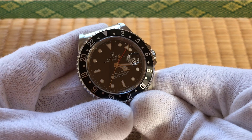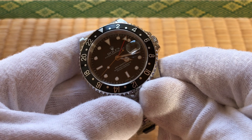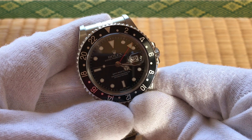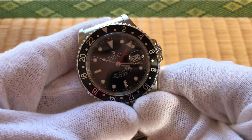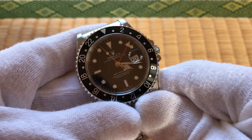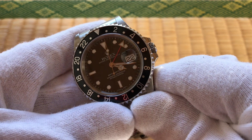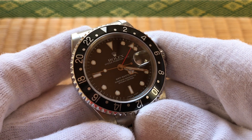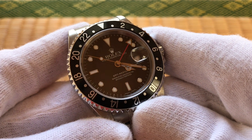After that I thought, all right, I'll just wear it. From the 14th to today, the 22nd, it's been on my wrist, and it seems to have lost about a second. So on wrist, this seems to be about minus a tenth of a second per day. But then off wrist, it seems to be about plus two seconds. The question is: why is it just a tad fast off wrist and ever so slightly slow on wrist?